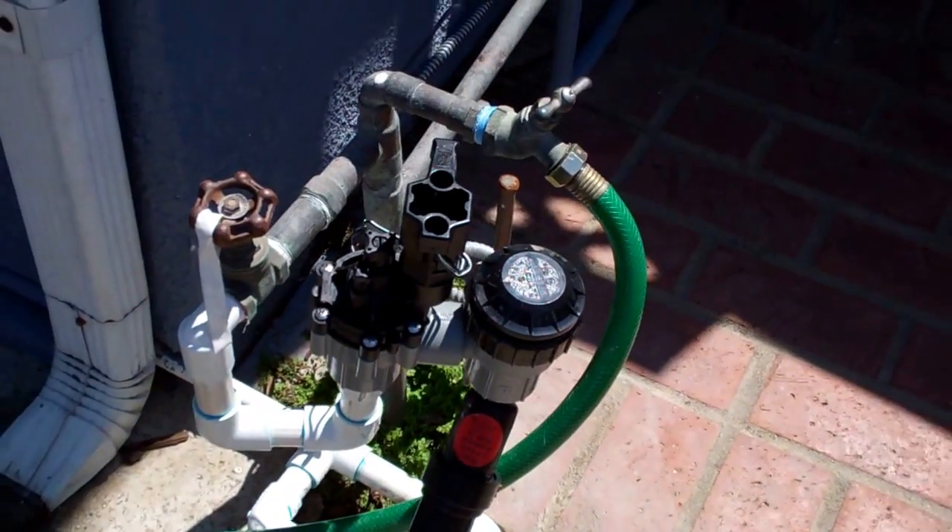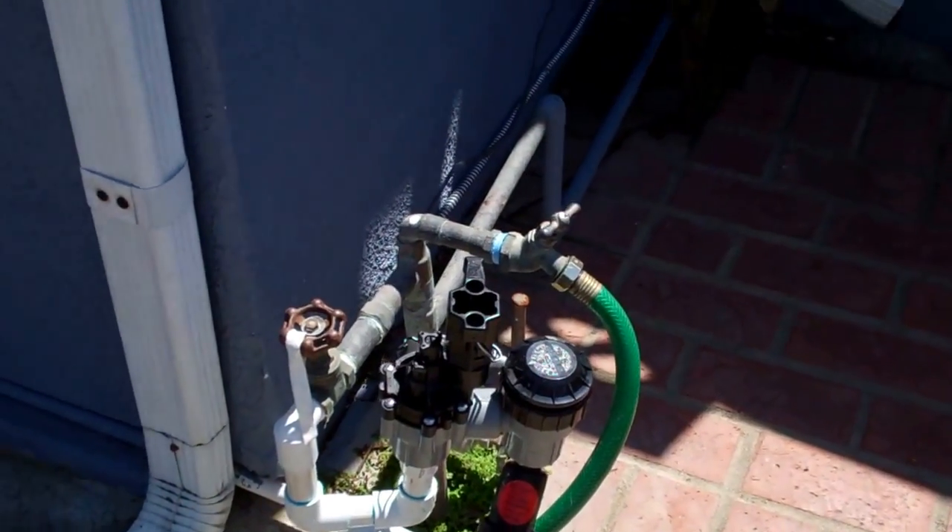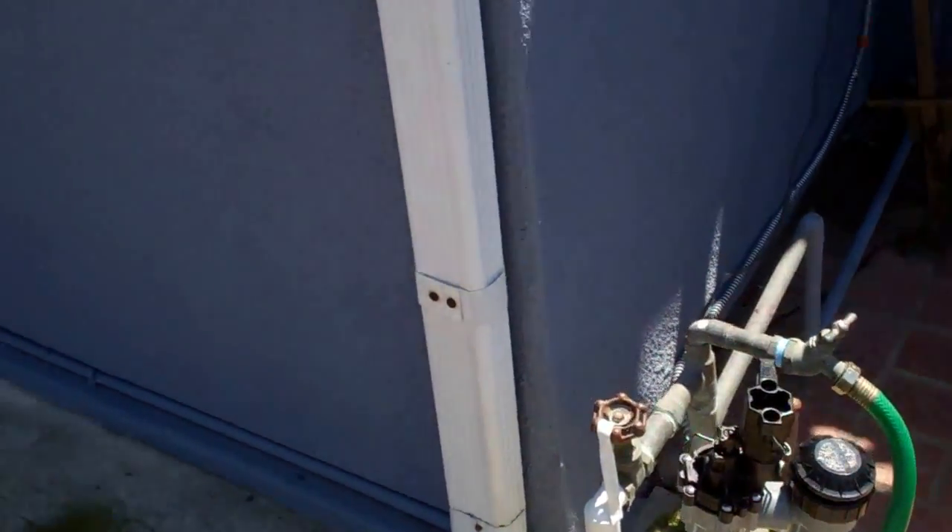It's very crucial to properly size all your filters. That particular filter can run anywhere from 0.2 gallons per minute up to 5 gallons per minute, which with the tubing we're using would equal about 500 linear feet maximum. The next size filter gets us up to 15 gallons per minute, which in bigger applications would equal about 1,500 linear feet of our 0.6 gallons per hour tubing. Those are numbers I always have to keep in my head so we can install the job the right way.